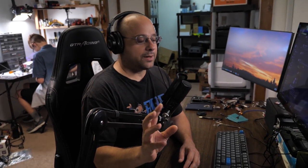Hey, Joshua. We need your help. What are you doing? I'm streaming. I need your help. The other pilots didn't really know what the difference is between 2207 and 2306. 2207 is taller, and 2306 is wider and shorter. But what does that mean? 2207 has a less linear throttle curve. It has more top end. 2306 is going to have a little more torque down in the bottom, but a more linear curve. Just tell me, which motor is better? I like 2207. But mine's a 2306.